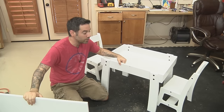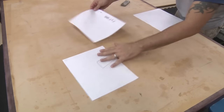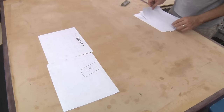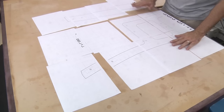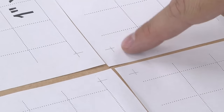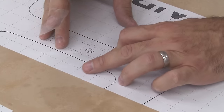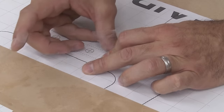We've got some plywood to cut and a lot of work to do, but this is all feasible within a weekend. Start by printing out the templates — no need for a special printer, just use standard paper and make sure you print without scaling. Use the corner index marks for aligning, and cut the papers to size with a straight edge and a razor blade.